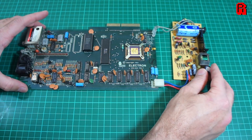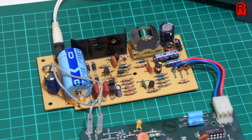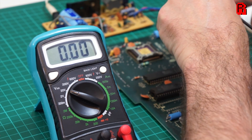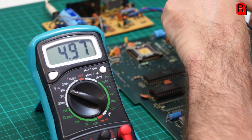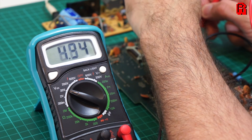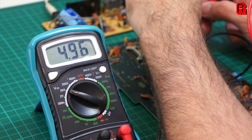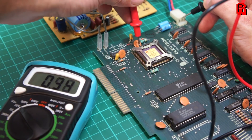So let's plug the power in and see what the components are doing. Now there's one other tool I could use at this point which unfortunately I don't have yet — I am saving for it — and that's a desktop power supply that would allow me to slowly increase the voltage to the board. This would be a nice addition to my tools, because we're essentially just putting our foot down on the accelerator when we plug this in and the power flows straight into the board. It's nice on these older boards to be able to ease that power supply up and gently remind these old components what they're supposed to do — a bit like when I try to go out for a run these days and start by walking the first mile.